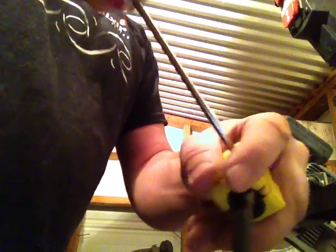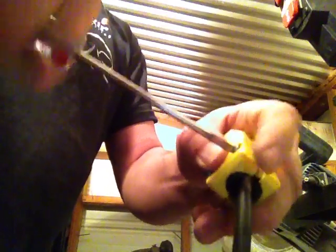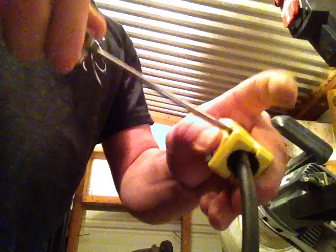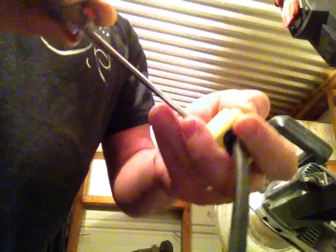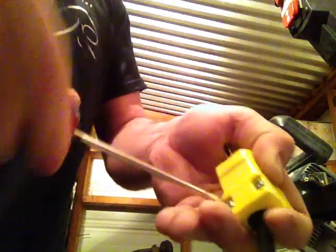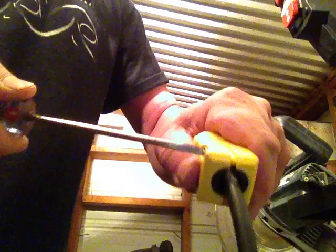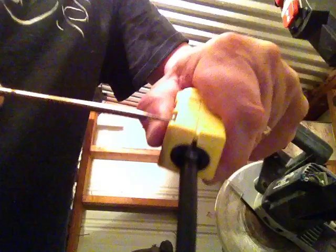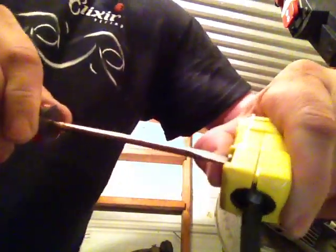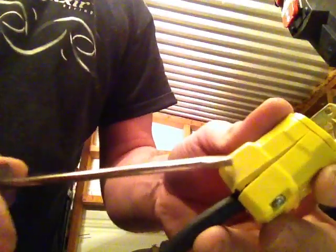This will make the cable be squeezed evenly, so you're not creating a hot spot on the wire. And once you get it all the way down, go back and forth maybe once, twice, 3 times, so you're tightening evenly till this gap closes all the way. Almost there. See some little gaps, still got a little ways to go.